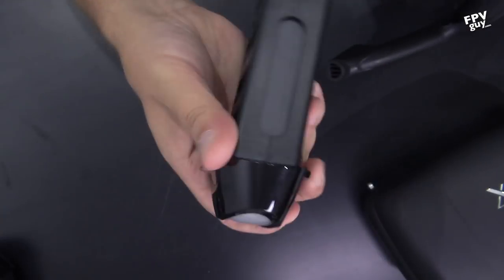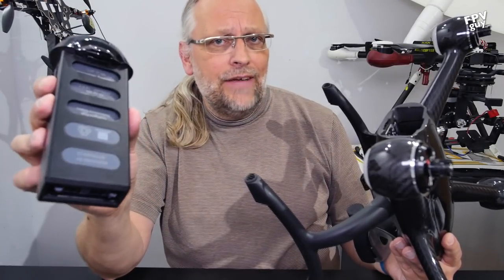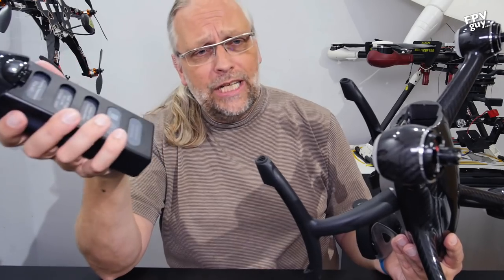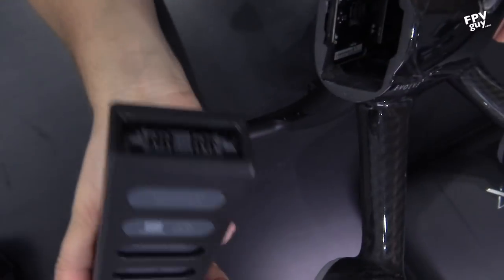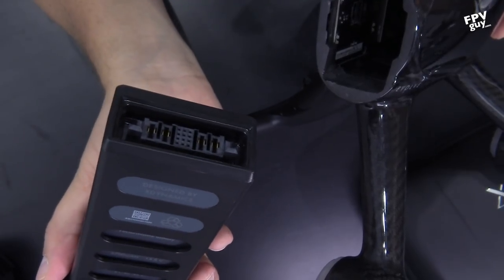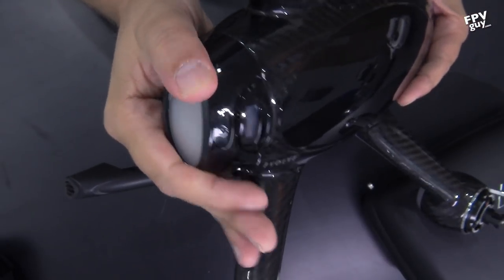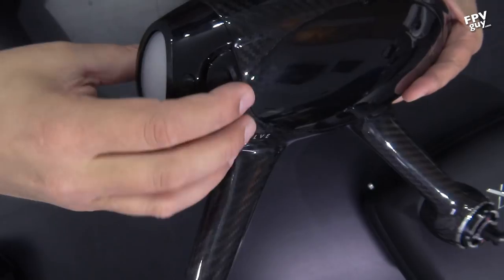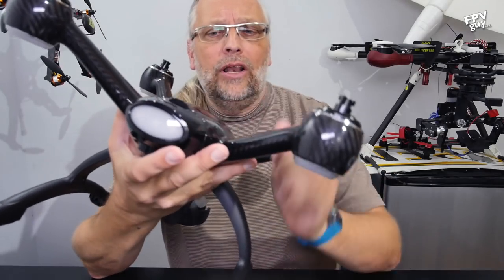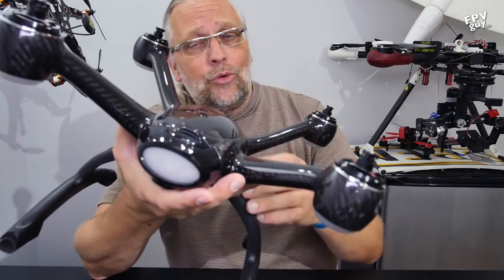The batteries are pretty straightforward. You can see it has a release mechanism, and these are basically 4S, 6700 milliamp — a pretty beefy little battery — at 4S, roughly 14.8 volts. Up on the end you can see it's able to monitor each individual cell with plenty of pins for both power and each of the four cells. Scoot that in and push it in — battery is in. To remove it, just push on both sides and pull out. On the back there's a colored light which is the standard aircraft status signal — bright solid green means it's happy.